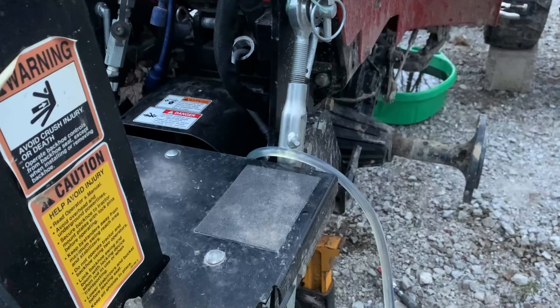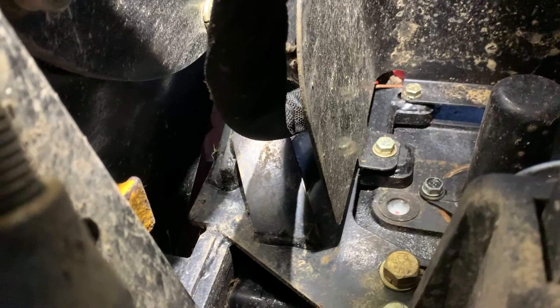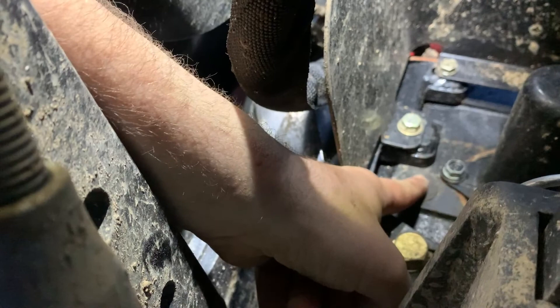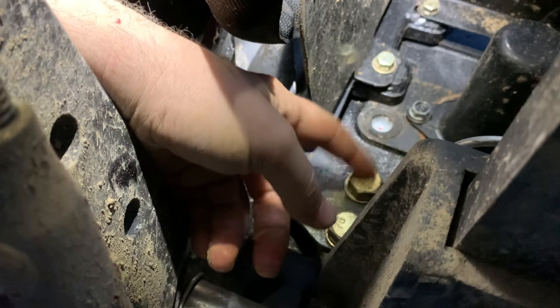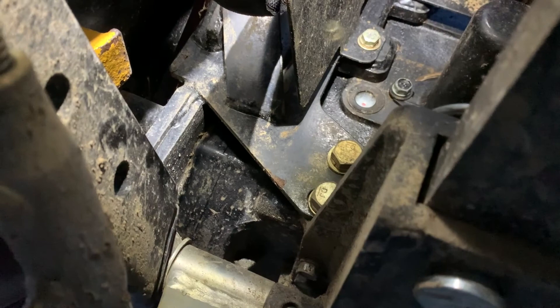There goes the fluid — all the way in. Crawling under the back end of this thing, like I'm right underneath the backhoe. If you look up in there, got a light on it. That right there ain't a bolt — that's the gauge. So far no fluid in it, but it'll fill up most of the way. Once that gets to half, you want to stop, close the intake, turn this sucker on, raise and move around all your parts — the backhoe, the front loader, all that stuff. Let it get going up and down, and then come back and check again because you'll have to add more.